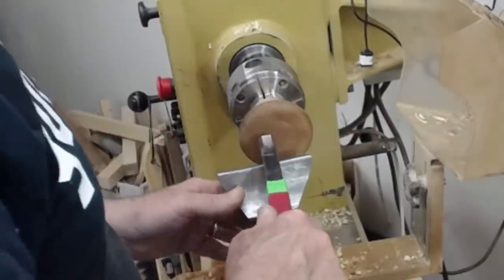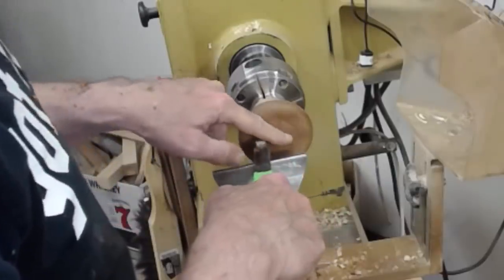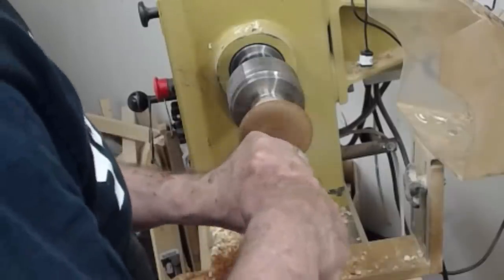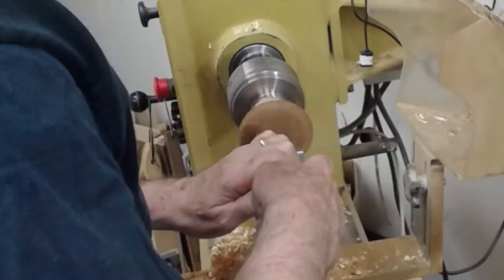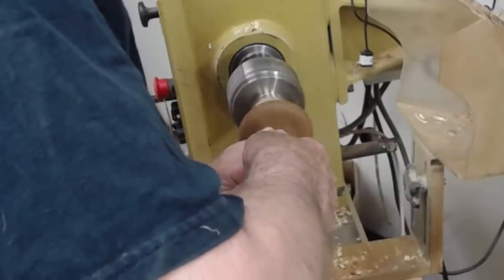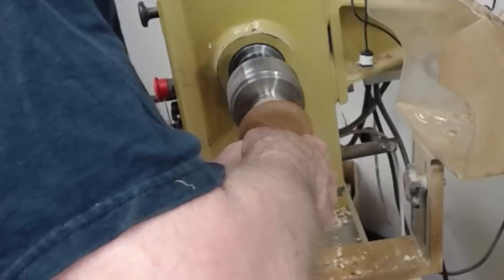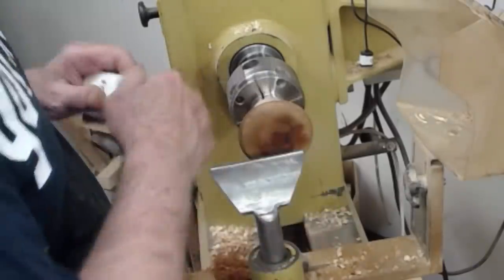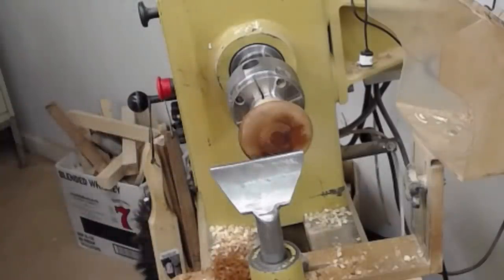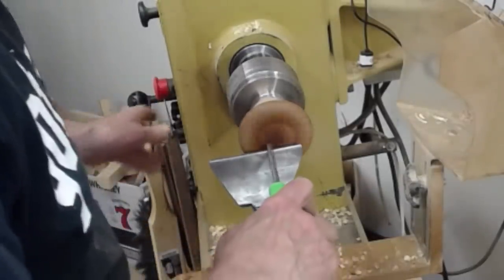There's an old saying: if you're a hammer, everything looks like a nail. I love texturing, so I look for every opportunity to use it. I've drawn a small circle in the middle to stay away from, and we're going to push this texturing tool in and let it embellish. We'll keep the speed down so it doesn't kick off — ease it in on one side, then bring it around. People who have a hard time with this texturing tool are often impatient; it's not cutting, it's embossing, and the harder the wood, the more patience you need. Then we're going to take a point tool and make it pop by framing it — just put a little there, maybe a bead or two on the outside.